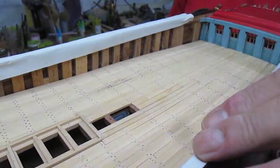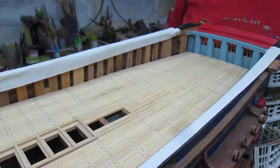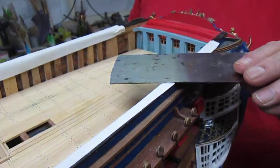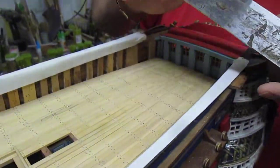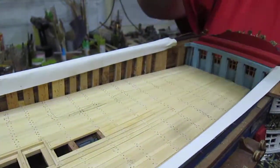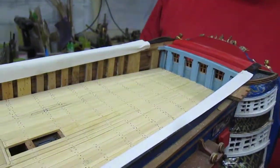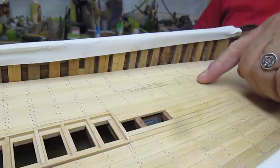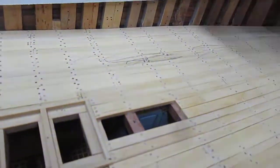I put these tapes on here to protect the wood because what I'm going to do now is use a scraper. This is a scraper — it's a standard piece of high-speed steel and it's been curved on the end. You use a piece of very hard polished steel to rub along the edge and create a tiny little curl that you use for scraping. It's a very old technique but it works very well. You'll see I've put pencil marks here because that's where I've got to get rid of some wood. So here we go.